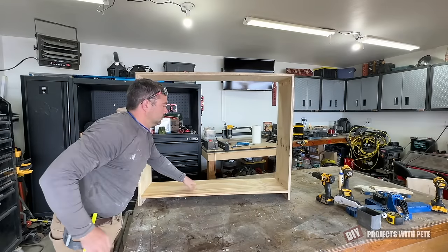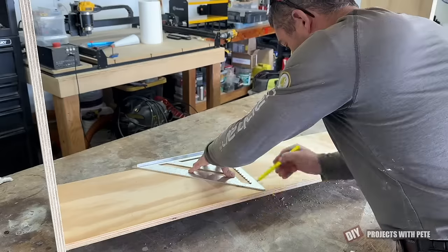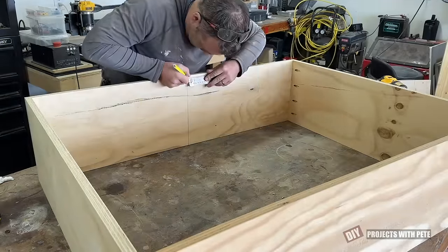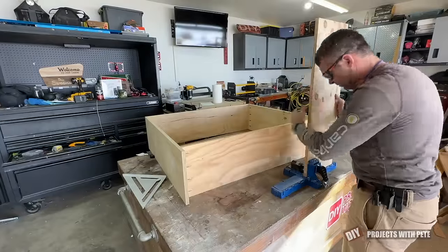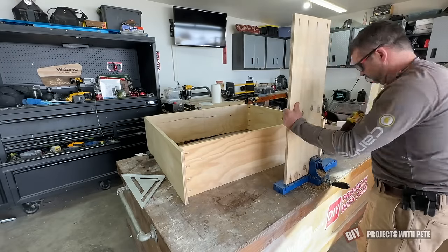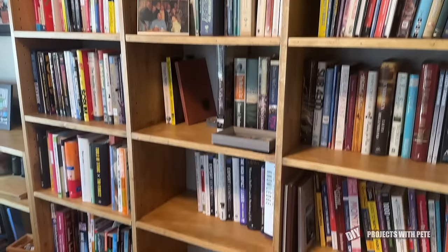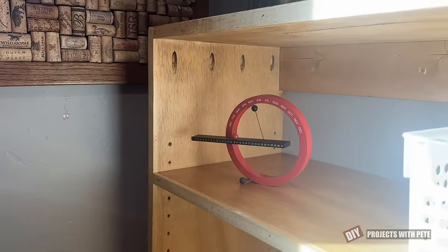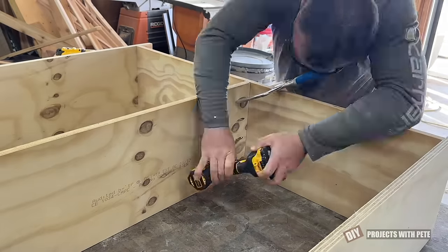As you can see, there's a slight warp in the plywood, but adding a second support will help straighten those boards out. Measure to find the center and use a square to make the marks to help ensure things go together nice and straight. After finding the center point, I like to draw a line on the side where the edge of the plywood will line up, then measure the distance between the top and bottom board to figure out the exact length that center support needs to be. I put the pocket holes on the left side of the board since you'll never see them because they'll face the corner of the room. The holes don't bother me and they blend in just fine — if there are books on the shelf they'll be completely hidden. Of course you could fill them with wooden plugs, get them flush, and stain them if you'd like. I finished up with the center support and used a clamp to hold it in place while I attached it.